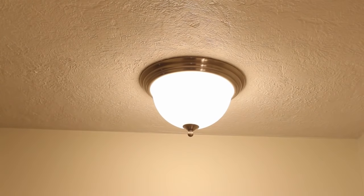And there you have it — that's how you install modern ceiling lights. Not too bad, right? Tons of different tips to follow, like taping the old light fixture to the ceiling and checking the voltage with a voltage detector to make sure you don't get electrocuted. And as always, turn off the circuit breaker or take the fuse out when you're working with electricity.